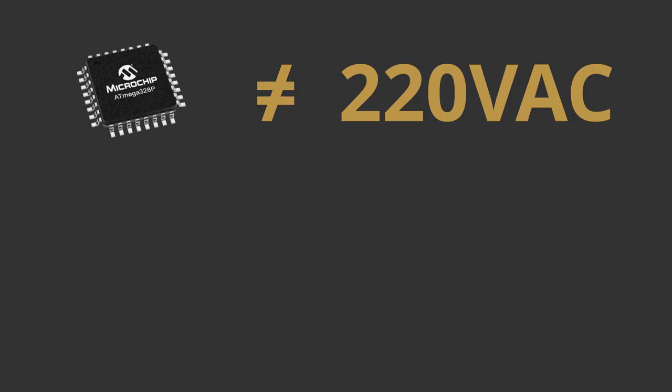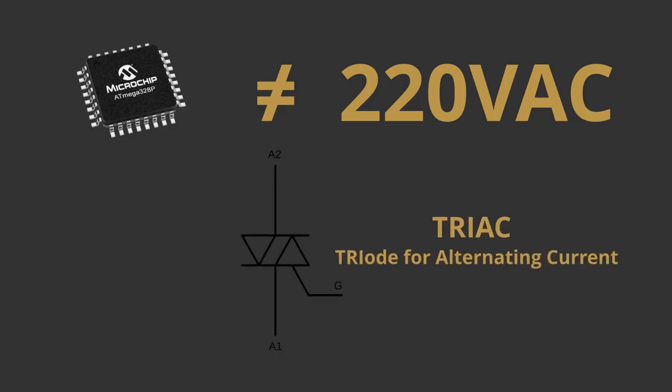Atmega chips use 5 volts DC. There is no way we could directly switch a voltage like 220 volts with it. Luckily, there is a component perfect for the job: a triac, triode for alternating current. When a triac is triggered, it starts conducting and only stops when the current falls below a certain threshold. Then we need to trigger it again.